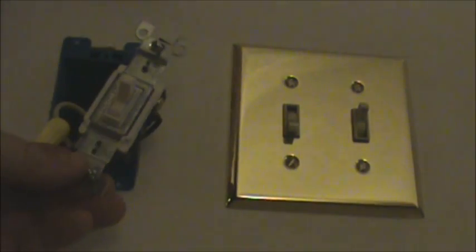Hook up both until you get a beep — that's on. When you flip the switch it breaks the connection — that's off. How you wire this up: one black wire goes to the black screw, the other black wire going to the light goes to the gold screw, then you wire-nut your two white wires together, and your two ground wires connect to the ground. That's how you get on and off.